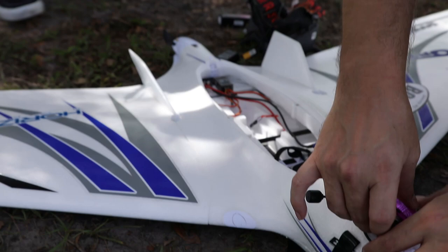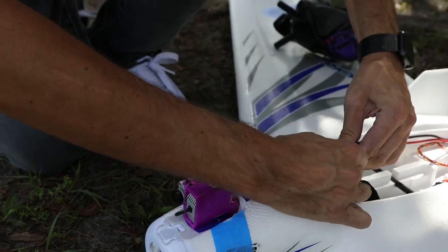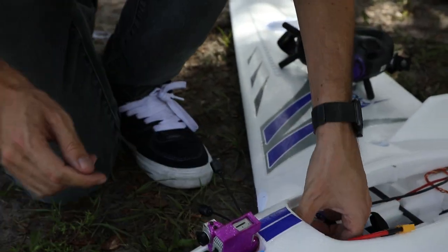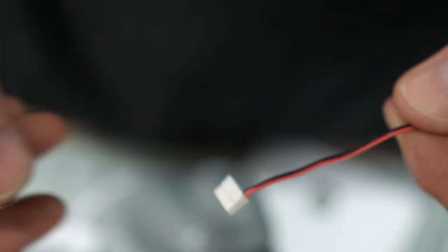As we've been using this DJI system, one of the more common questions is, how do you wire the thing up? Because there's like 6 or 7 wires that come off of it. It can seem a little daunting where all these wires are going to go, especially in something like a wing. But the beautiful part is, we only have 2 wires. You've got ground and power. You only need to power it to send the video to you. Everything else is for more telemetry information, like your battery, and for the control link. But we're not using the control link. We're going to use the Spektrum radio, and we're not too worried about the telemetry information. So all you have to do is power the thing up, and it's going to send beautiful HD video back down to the ground.